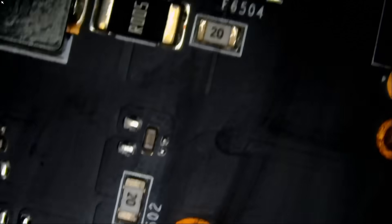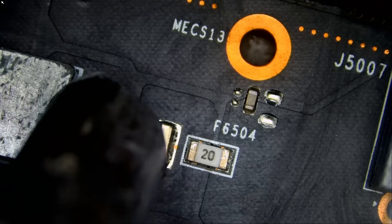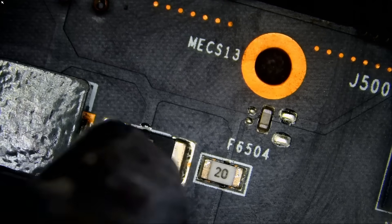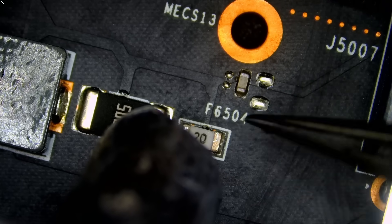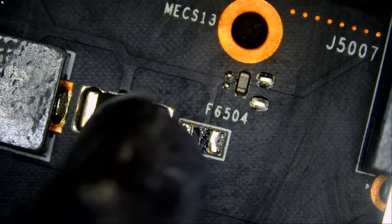Can we just replace the fuse and fix the card? Too good to be true. What do you think caused that fuse to blow? Let me know in the comments. Let's replace it. That fuse does not look blown, but it's open. We do not just go by the looks — we have to measure, unless it's obvious that the fuse is blown.